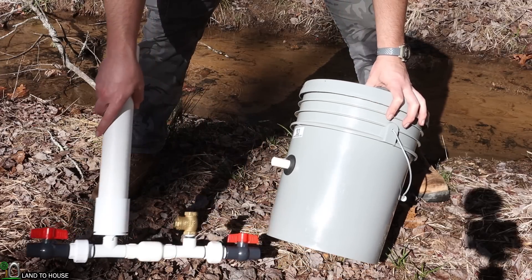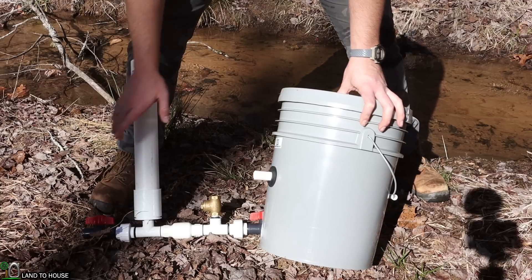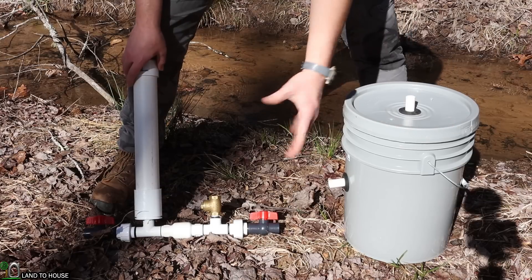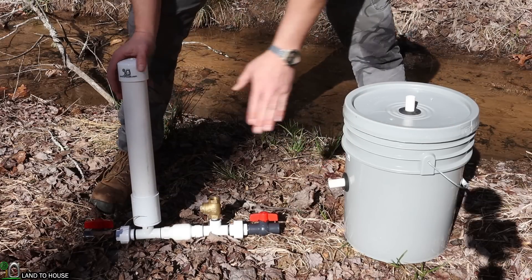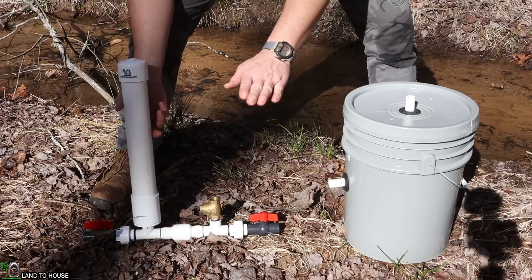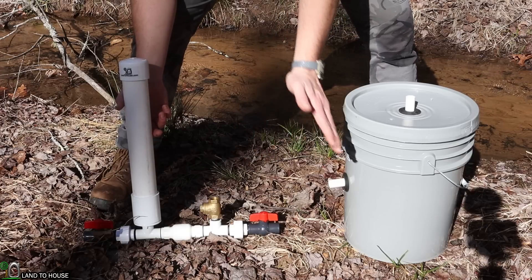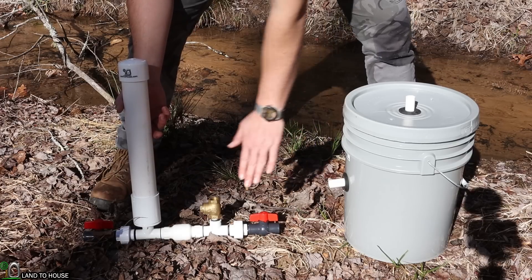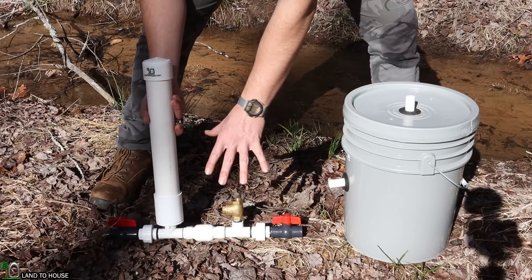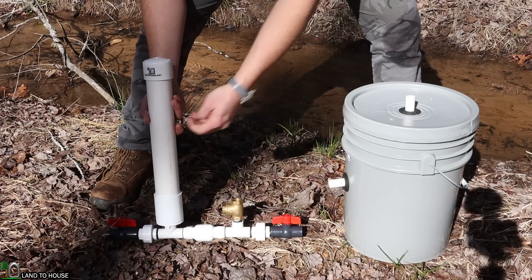For the half-inch pump, I'm going to have a half-inch drive pipe connected here, and that will go from a PVC pipe down to the pump. From this point here down to the pump is the head pressure — the water drop that brings the water down to the pump. For every one foot of drop, it will lift between seven and eight feet up the hill.